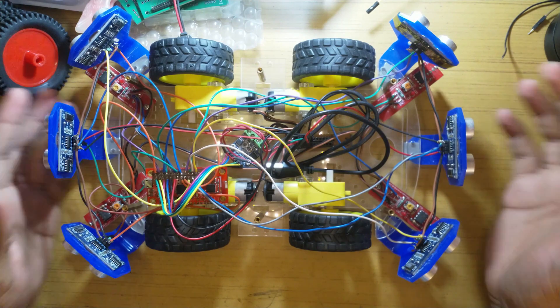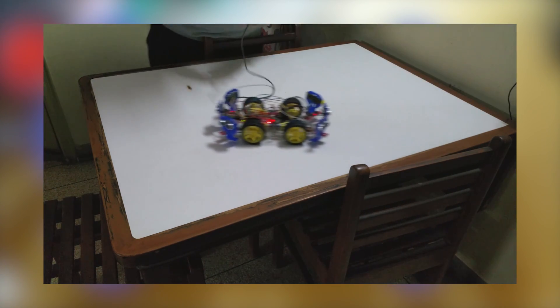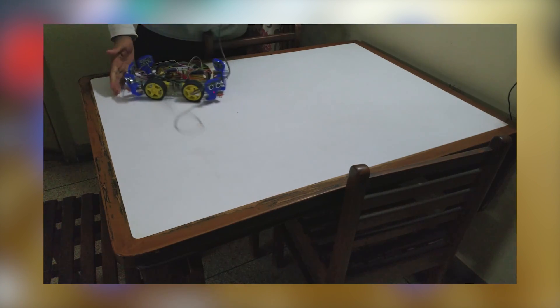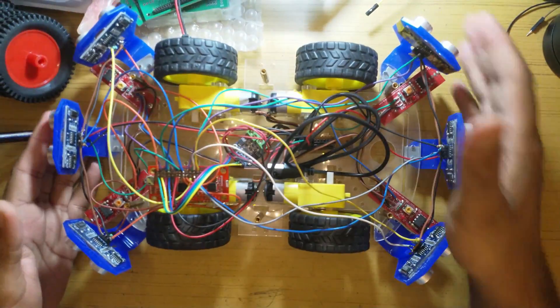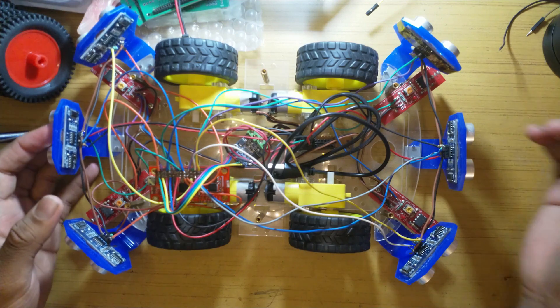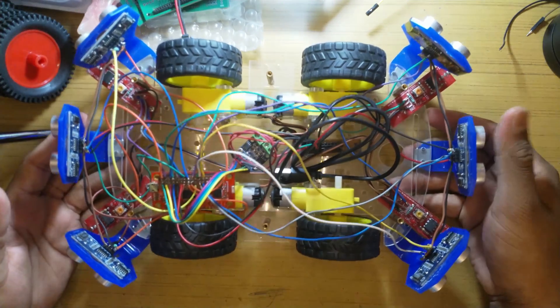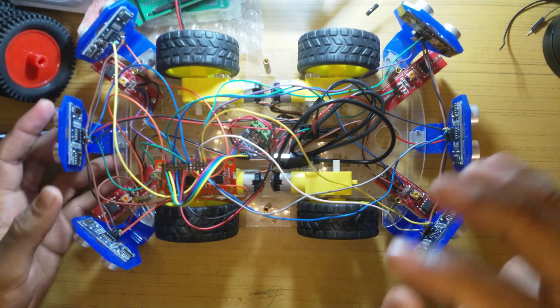To keep everything low power, the sensors already are, and I've used a microcontroller. I'll show you a video from Open Hours — this is me just trying to create virtual obstacles with my hand to activate the sensors, and it actually works pretty well. There are a few issues right now, but let's get into how I ended up controlling all the sensors and motors with a microcontroller — and that is because of the help of Zephyr RTOS, or Zephyr Real-Time Operating System, which is funded by the Linux Foundation. It's an open-source real-time operating system.